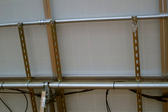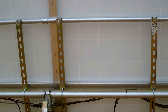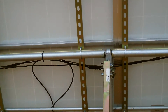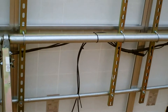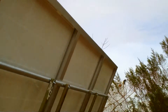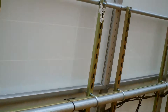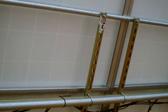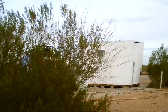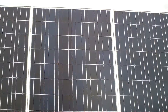This is designed to be on a tracking system, tracked from east to west throughout the day. We don't have that part working yet — I'm working on that right now. You can see the pivoting hardware there and the frame systems that it's on. These panels weigh about 300 pounds on each one of the setups, and they move really easily. An actuator's not going to have any problem moving those at all. I decided to go with a pneumatic system on that. I've been doing controls for a lot of years, I'm familiar with pneumatics, and they tend to be a lot more reliable. They create a lot of torque and they're a lot less expensive.